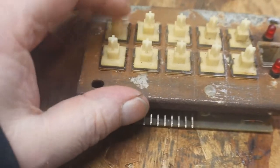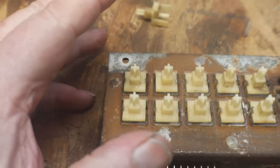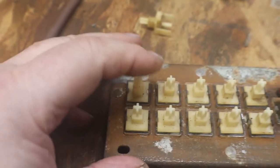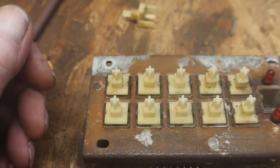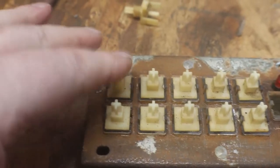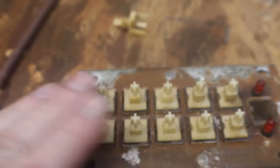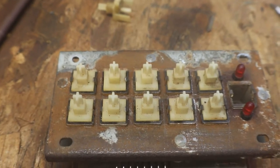I know I cleaned one and two really good, because those are the only two that work for your first digit — either you have to have a one or a two, side A or side B. None of these other ones will work as your first digit. So I made sure those two were cleaned up. I know those two I don't have to check, but the rest of these I do — I'll have to pull all of them again and see if they're still dirty.